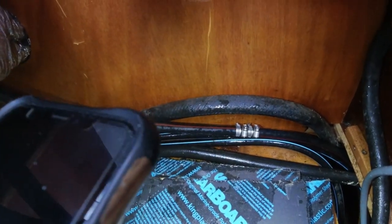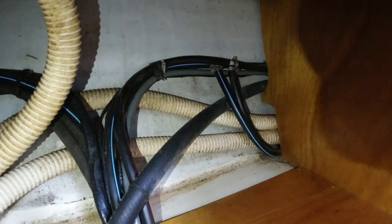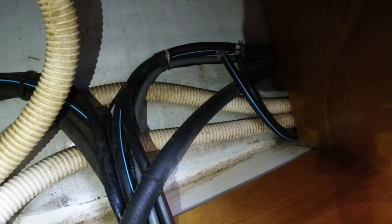Instead of being pinched, it's going to just get scratched through. My next option would be to insulate that with something, which would add thickness and make things tighter. Or that line basically goes through underneath this area, comes up here, goes out towards the hull and to that T-fitting. If I get a replacement line that's long enough to replace the whole thing, there's no seam in it, which is nice — but it's a pain. It's probably the best thing to do. I need new half-inch hose to replace this the right way.